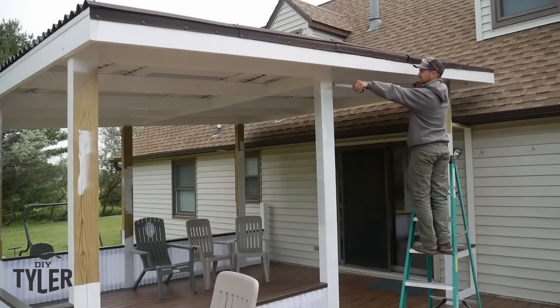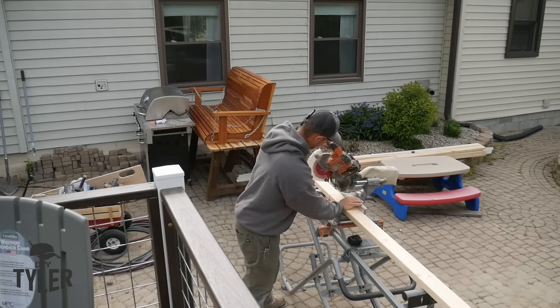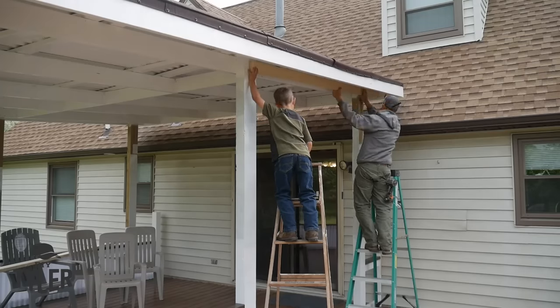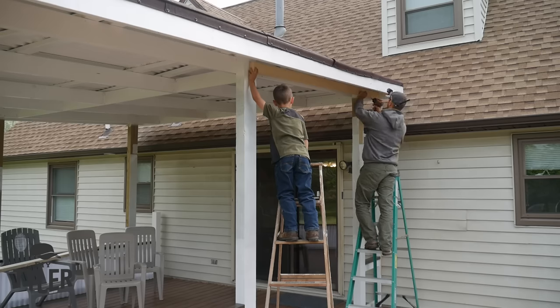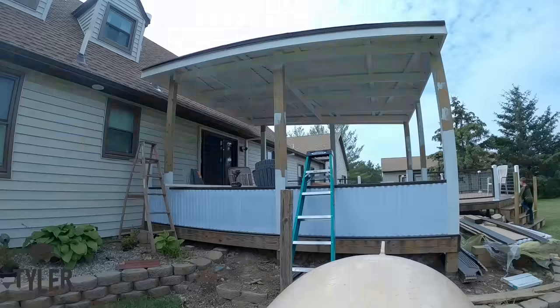While sitting and thinking about what we still need to do for the screened-in porch, I realized we need a little more blocking for two reasons: we want to put soffit in here using the Ondura Toughdex panels for mosquito-proofing on the outside, and it will give us a good anchoring point on top to keep the screens tight so they don't flap in the wind and tear. So we're going to add some blocking, get some paint up there, and maybe get the soffit up there too.